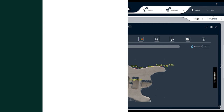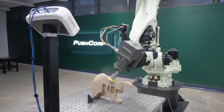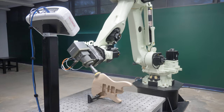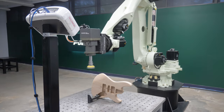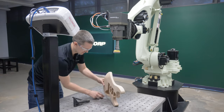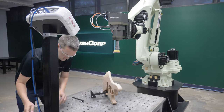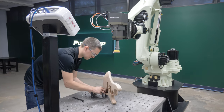Let's see it in action. The AccuPic camera takes a photo of the part and quickly determines the offsets to send to the robot. As the spindle is readjusted over the part, the compliance device is maintaining a constant force. Now I'll refixture the part in a random location and run it again. As long as the part is fixtured within the camera's view, it is able to determine its location to make the appropriate offsets to the robot path.